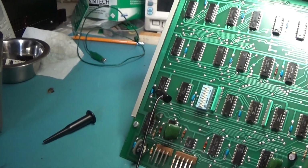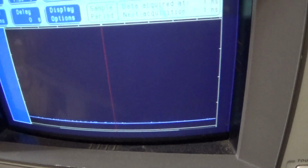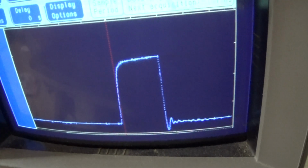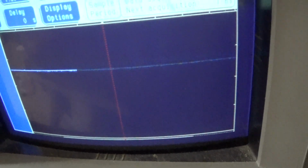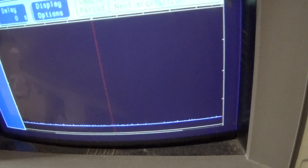And if we look at that thing, here is the clock. Okay, that's the clock signal. Here's the clear signal. No clear. Here is the count enable. So we have a count enable. And then we have the other count enable, the trickle enable or whatever it is, right here. And we have a load signal, no load signal, so we're not loading any. So it should just be counting freely.